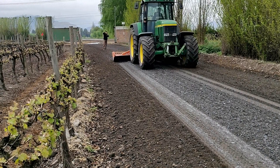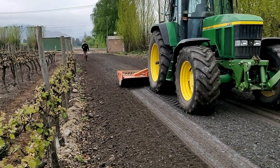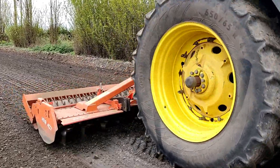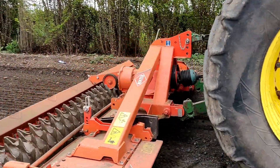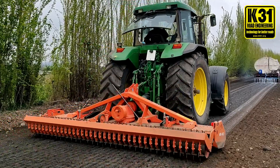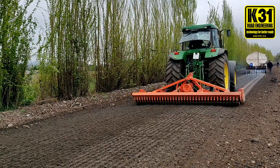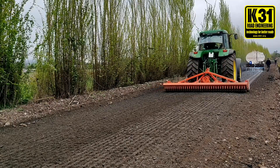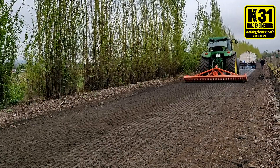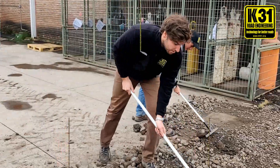The tiller is not only going to mix the soil with the APS, but it'll also keep chipping and grinding, making the soil particles smaller and smaller. What that'll do is, when it comes time to roll and compact, you will have a very nice and even surface. Versus not using a tiller — you can do it with the blade of the motor grader, but you'll never get that fine crushed soil. Without the tiller, when you go with the roller, you're going to have a lot of bumps and have to do many corrections with the motor grader after. By doing it this way you pretty much eliminate even having to come back with the motor grader.